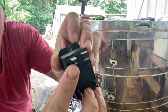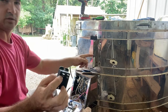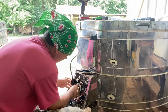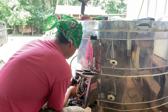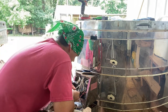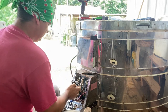I don't know how well you can see, but this one — you see how it's loose? It got hot right there and melted that. So what it's doing is it's not sending signal to my elements — a whole set of elements was not cooking. I've got two of them that are like this. One of them is burned out bad, actually — two of these. One whole side of this looks burned out.